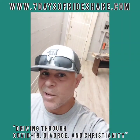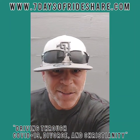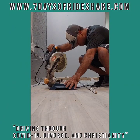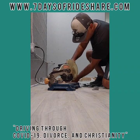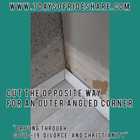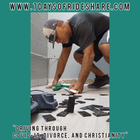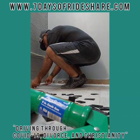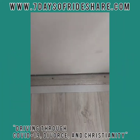300 square feet down in one day. We'll come back tomorrow and shoot the quarter rounds. Let's shoot the quarter rounds and the moldings. You've got to cut your angles at 45 degrees and check them out before you put them in — that's how it looks when you cut your angle at 45 degrees. This piece you've got to glue down because there's concrete and there's no way for the nail to go. Now you finish the floor with the quarter round, put your T-moldings, get them glued down — those are your transitions. Then caulk, and it's time to go home.